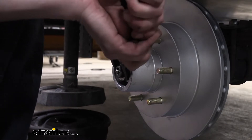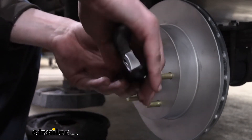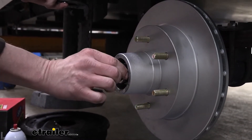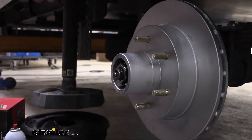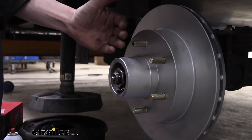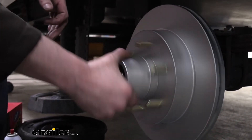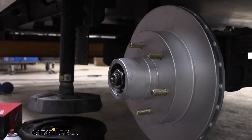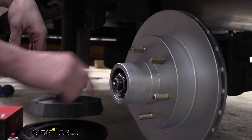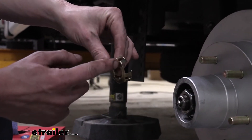That felt like the end there - put a little bit of extra force on it just to make sure everything is fully seated. It should feel kind of stiff when you give it a little turn; we don't want to turn it too much. That's what we're looking for - we know we are fully seated now. Now we're going to back it off until it's fully loose to where you can turn it by hand, and then turn it just until it touches by hand. That's where we want our bearings to be set, so they don't have a preloaded pressure causing them to grind into each other, but we don't have excess play that can cause damage. It should feel nice and smooth when you turn it. Our retainer goes on next - there's a flat surface that lines up with the flat surface on the spindle, and the corner edges will go in between the two little prongs.